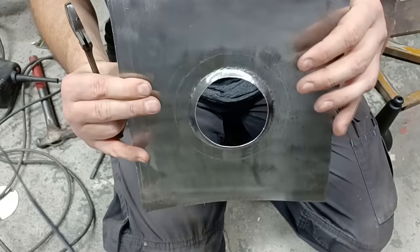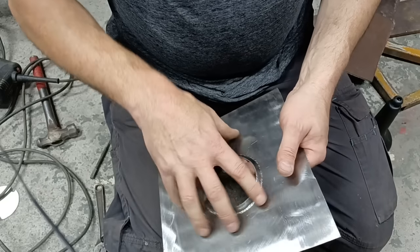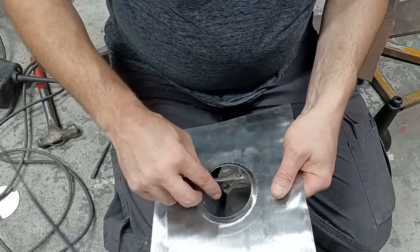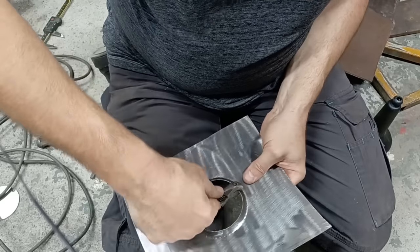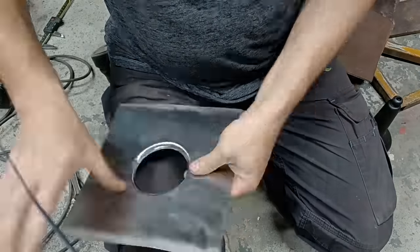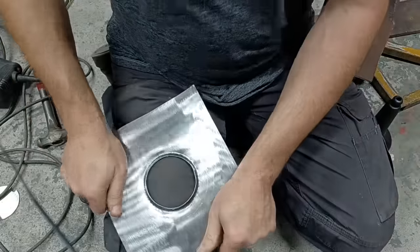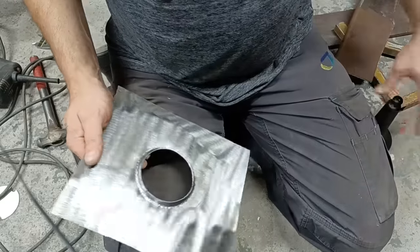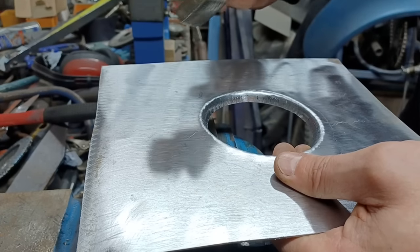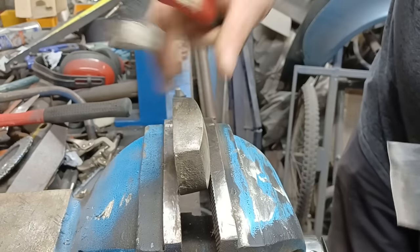You can see this is starting to go out of shape now, but what I'm hoping and planning on — once it gets up to upright — I can start, because obviously you're stretching this out as we go in. But as it gets up to upright you can start using the hammer and dolly to bring it up, and that will stretch it back out again. I don't think we're far from using the hammer and dolly now. I'll put my dolly on the bench and try using the face of that — it's kind of rounded — so we should be able to tap that up upright at least. Let's give it a go. At the same time, this should be stretching the metal out.